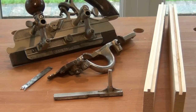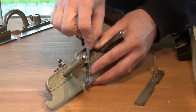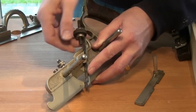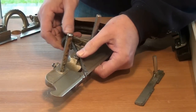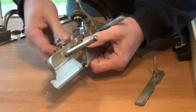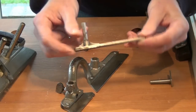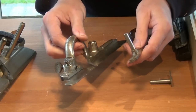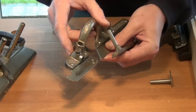We're going to be using the beading gauge. First of all I'm going to install the beading cutter in the same way we do for standard beading work that I showed in my video earlier in the series. Adjust it for a fairly light cut and tighten it up. Now we need to install the beading gauge into the sliding section, and that goes in at the front where the auxiliary depth gauge normally sits.